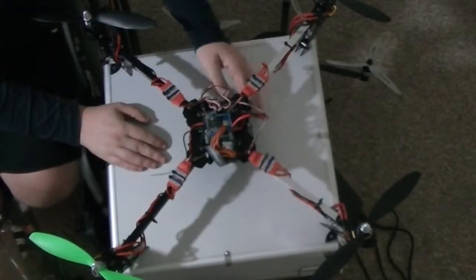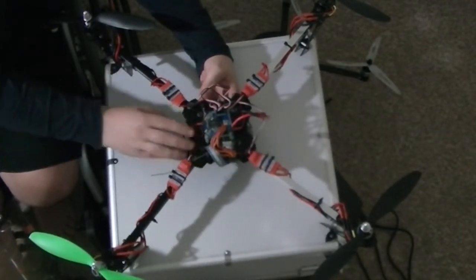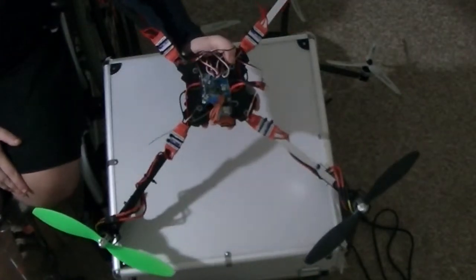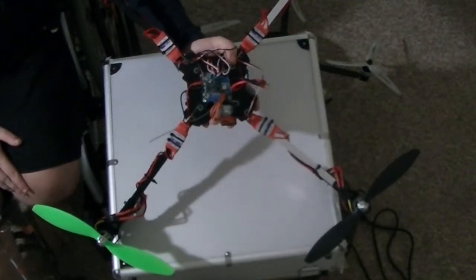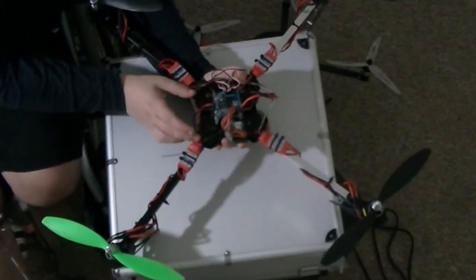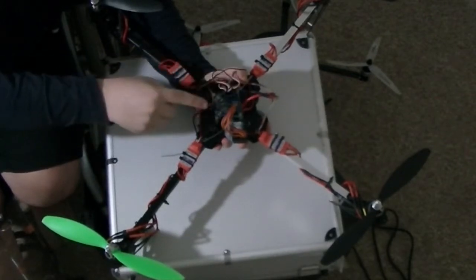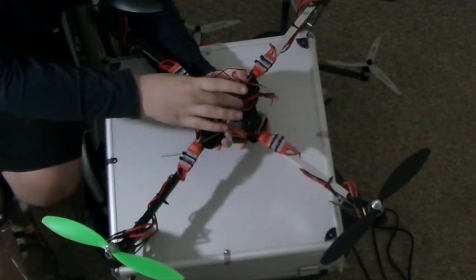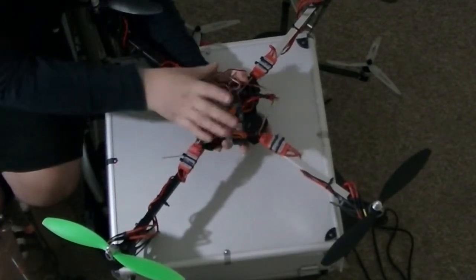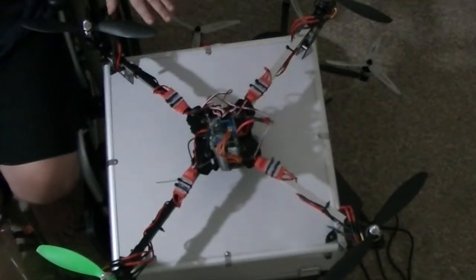The flight control board itself has a couple of little arrows that have to go towards the front of the quad. Now looking at this, you say, well, what if I want to put it in X configuration? Very easy to do. All I do is rotate this around. The HobbyKing frame actually has slots all the way around so that you can mount this on a 45-degree angle to the shape of the board that it sits on. So HobbyKing have really thought that through.